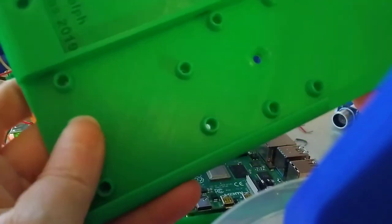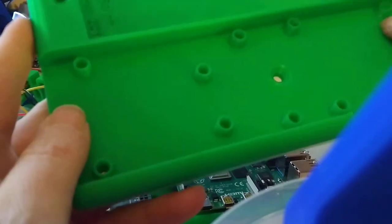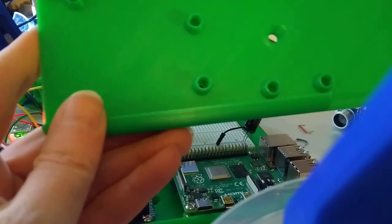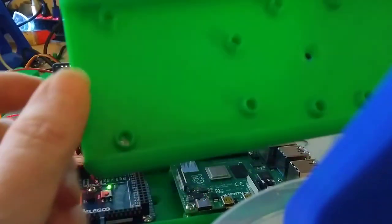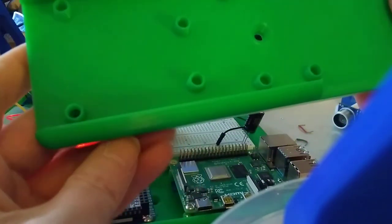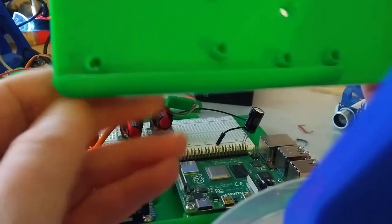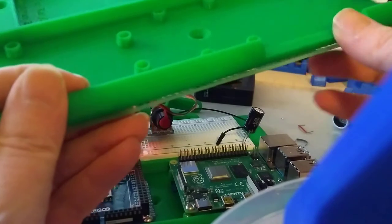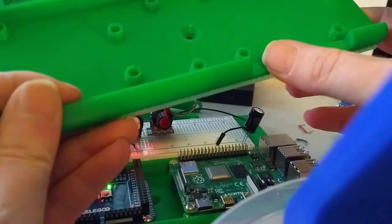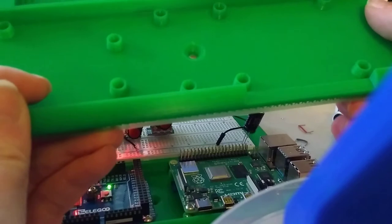This is where the Pi and the Arduino go — you can see there are some plastic standoffs to keep them away from the bottom. I've designed it so that you can still remove the SD card. I've seen things like this on Amazon, which is kind of what inspired me, but they're a bit too small — once you've got the SD card in and the Pi screwed down, it's not possible to remove it again. Also, the section in the models I've seen isn't wide enough to support the Raspberry Pi 4, which has more connectors along here that stick out through this hole.